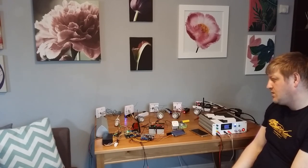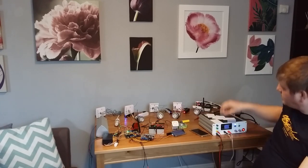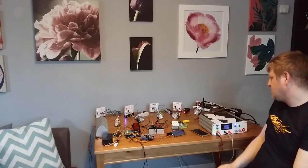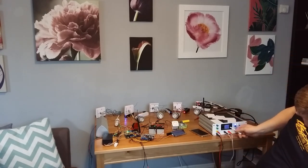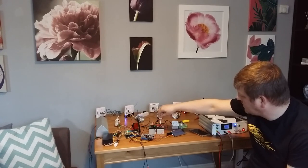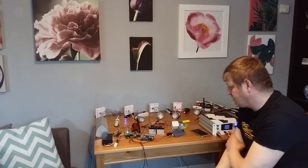And then I'm gonna be pretty well with that. Before installing it inside the house, I might leave it like that for at least 48 hours running on the table to be sure there is no problem with the power supplies, because they are quite small and I want to be sure that I'm not mounting it in the house and then it just fries. Then I need to make another small transformer that gives me 14.5 volts to power the battery charging, because actually it is running on the battery, not on the power; the power just feeds the battery to keep it always fully charged.